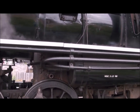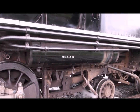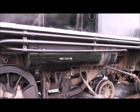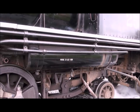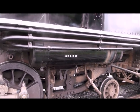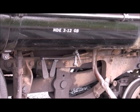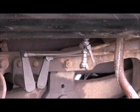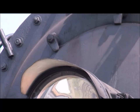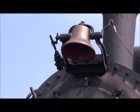We also have the compressor and these cooling fins. We're trying to get the moisture out of the system — if you get moisture in the system, you can have that hydrostatic lock, or it can freeze, or it just makes things rust and fall apart inside. So what we try to do is get the most amount of moisture out of the air before we put it into the brake system. That valve in the bottom is so we can drain the water out of these accumulation tanks, and I generally drain them three or four times a day. And of course, there's a headlight in the front and the back, and don't forget the bell — the fireman's going to be ringing the bell a lot of the time.